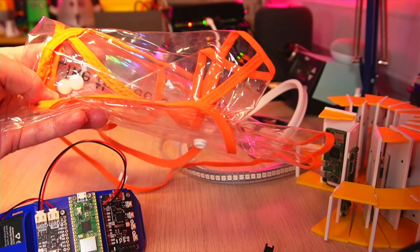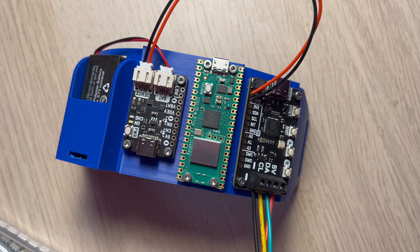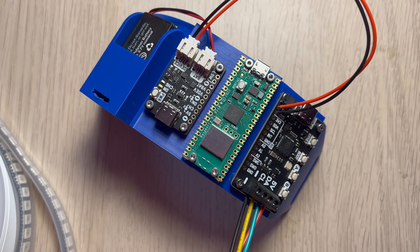I've got a number of RGB LED strips, and this is the dog coat I'm going to use. What I'm intending to do is hot glue the RGB LED strips onto the coat and then connect them to the Plasma 2040. The Plasma 2040 will connect to the Pico W, which will be providing the wireless access point and Wi-Fi control. I'll create some routines on the Plasma 2040 and it'll listen over UART to the Pico W for commands and execute them. The Galleon battery connects to the LiPo Pro to provide local power.